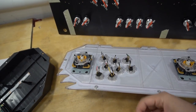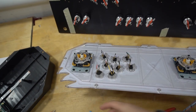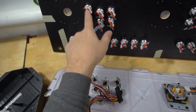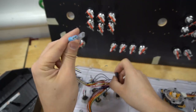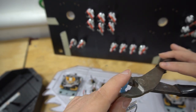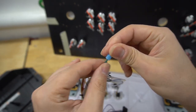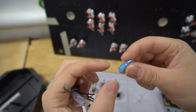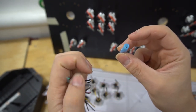Now I'm going to show you real quick, going along with what I said, if you do go about getting the Home Depot connectors, you're going to take your wire. You could do it with a scissor. So now basically this is where the tedious part is. You're going to have to do that times 22. And then just to really show you the real way, but I don't want to waste the head, this is the actual crimping tool. You basically take this and then you squeeze it, and it will definitely be locked in for life. This right now, yeah, I could pull it out. I didn't squeeze it too tight, but that's the one downside with using pliers. You do have to really squeeze this hard.